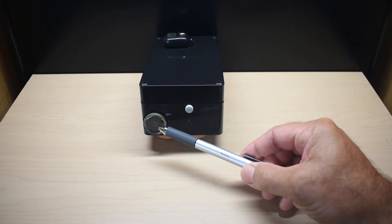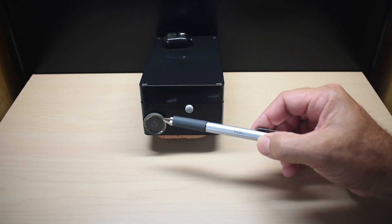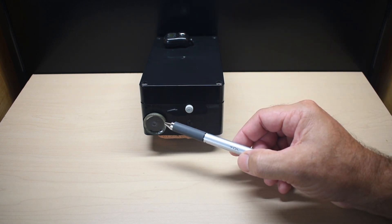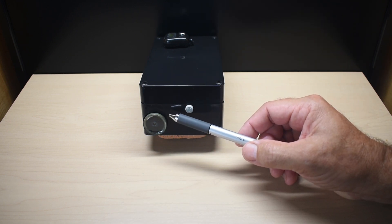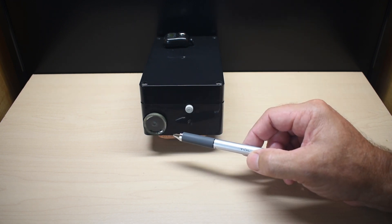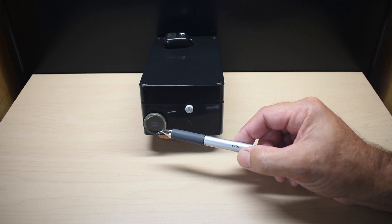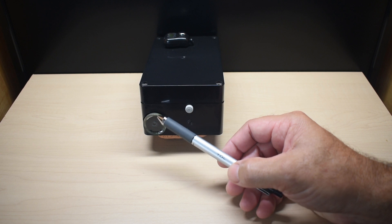You can see there's a mica window, slightly concave because there's a negative pressure inside. There is an inert gas such as argon, neon, or helium. You have to put a charge on the gas in that tube in order to have detections take place. This tube requires a minimum of 680 volts applied to the anode. The outer edge all the way around is the cathode.